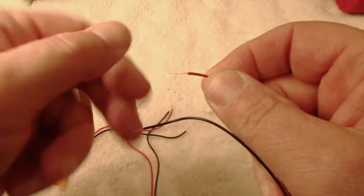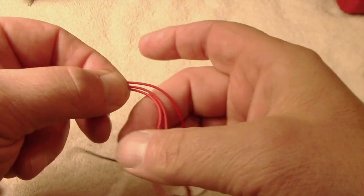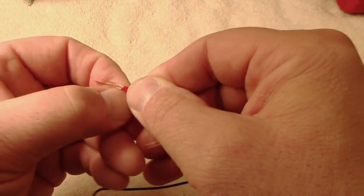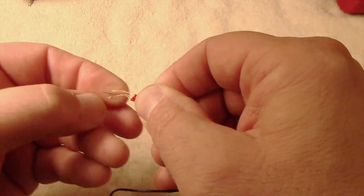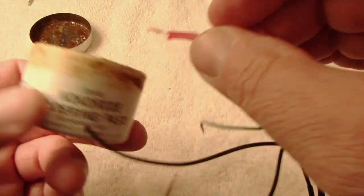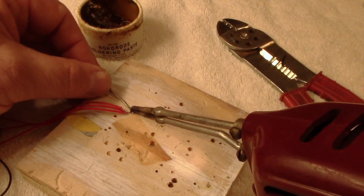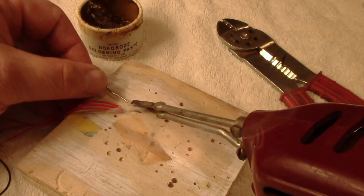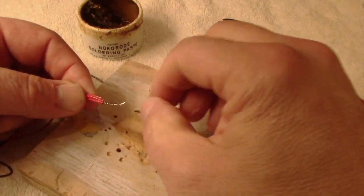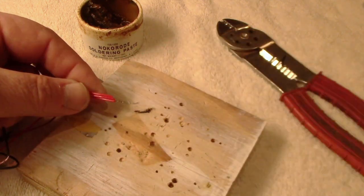This will be the first time that I've ever used a bridge rectifier in a project — it will convert the AC voltage from the transformer into DC for these LEDs. I've stripped away just a little bit of insulation so the copper stranded wire is exposed. They were twisted before combining the reds together and giving the three wires a twist into one unit. A little bit of flux will help the solder flow into the wires once they've been heated up, making a strong and secure connection less likely to flicker — much more reliable than using wire nuts.